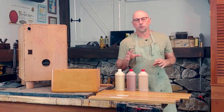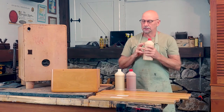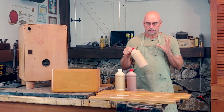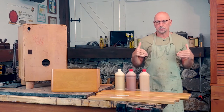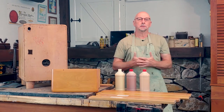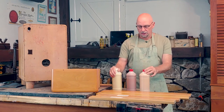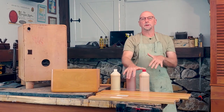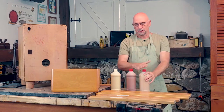Here are some things to know before you get started with these products — they are different than probably any product you've ever used. They're specifically designed for Heywood Wakefield to give an exact color on this very dense wood, which takes a different type of finish and stain. There are a lot of colors added and they're designed completely differently than any standard stains, so you really need to follow the directions.